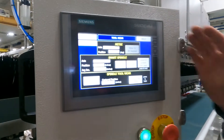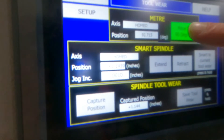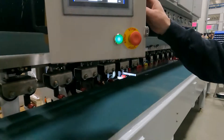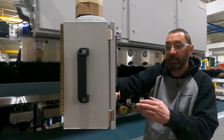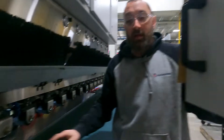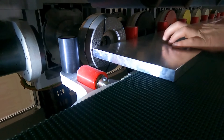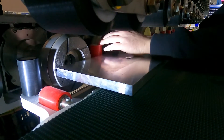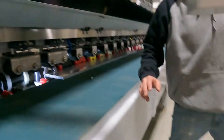Once we get to our tool wear screen, we're going to press and hold the miter to 90 button and bring our miter down to 90 degrees. I'm going to swing my screen around so I can touch it easily. I have my aluminum bar set up and I'm going to push that up against the red rollers so I'm right in front of that smart spindle tool.